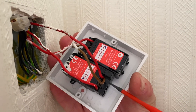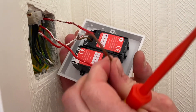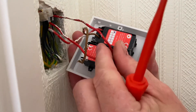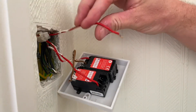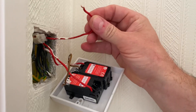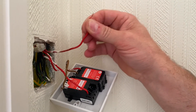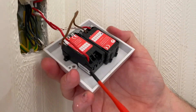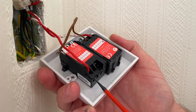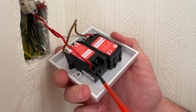This is the permanent line connection and it's got that bridging link as well, which we'll probably need in the new dimmer, so we're going to keep that. That's my permanent line connection — you might want to mark it or just fold it out of the way. That's my feed into my common, and it's going to remain into the common in the new system.